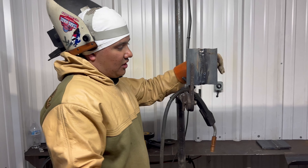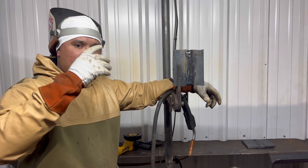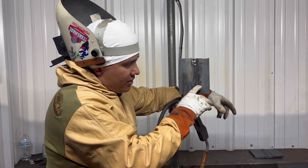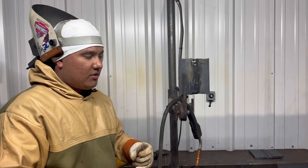All right, so we got it down this time — we got some porosity right here on the bead. Whenever you're welding and you lose gas, you'll see a lot of buckshots flying out and more fume coming out of your weld. Pretty much right behind that wire where you're laying down the metal on your puddle, you'll start seeing that porosity just popping up.